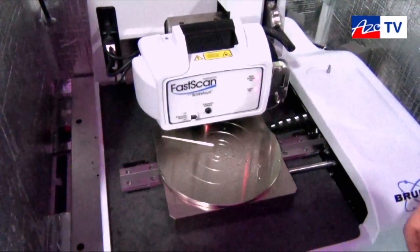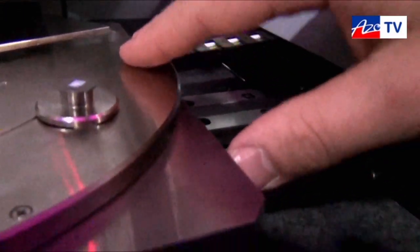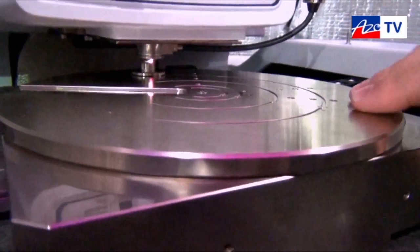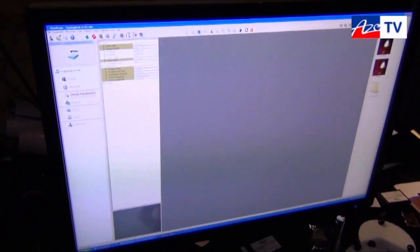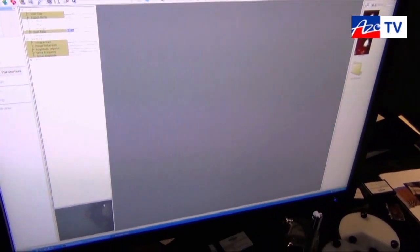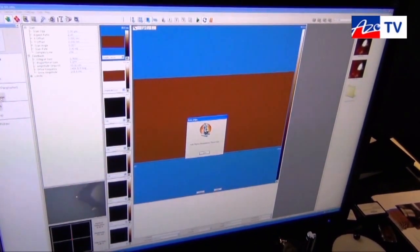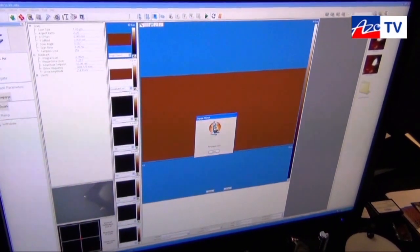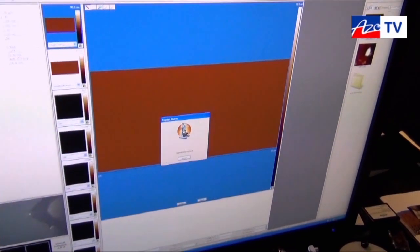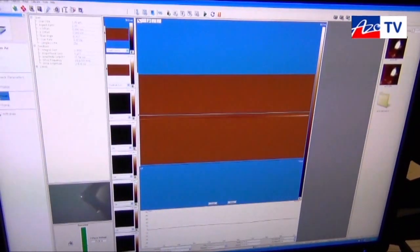That would be a typical workflow. You can see the sample placed on a small mount for small samples — you can use magnets, or place them somewhere on the chuck. You rotate the sample below the scanner and engage, here at a slightly slower speed from the beginning. You can see how quickly we get down to the sample. It does some pre-alignment, then the motor moves down, and within a few seconds the surface is reached — about eight further microns of motor travel and we are down on the sample.